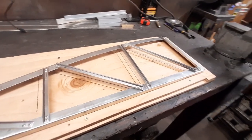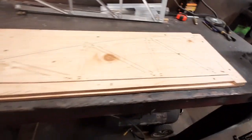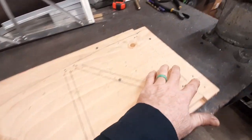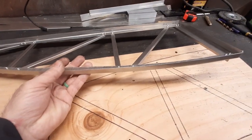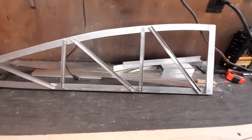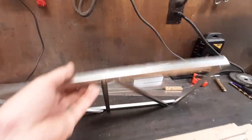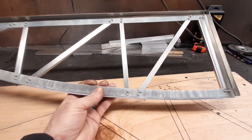You have to have the right kind of aluminum, but just drop pieces cut off something else can be used instead of thrown away. The first thing you need is a jig. This section was cut out and then screwed onto another board so you have a groove all the way around to put the downward bent parts of the rib in. These marks show where the reinforcements go. Everything gets riveted together — you can use eighth-inch pull type rivets, which is what I'm using, or save money with 3/32 solid rivets.